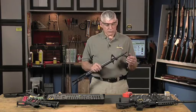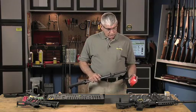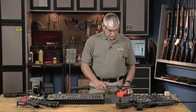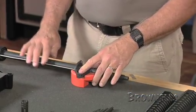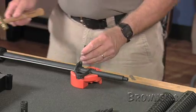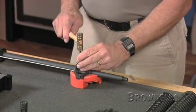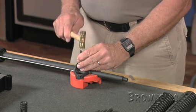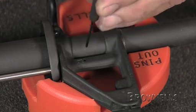I've already removed the muzzle brake so it's out of the way. I'm going to use the front sight block here. Get it on the table nice and sturdy. Then I'm going to get a roll pin punch and drive out the gas tube pin.